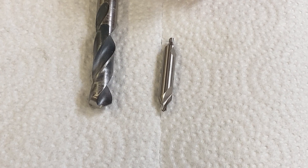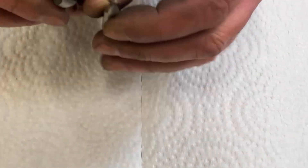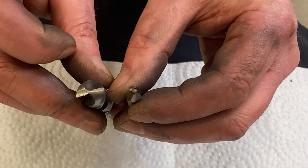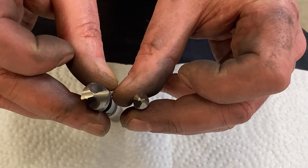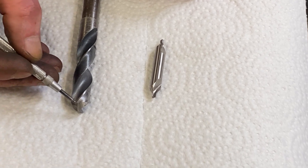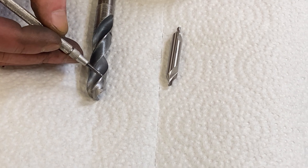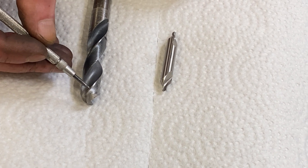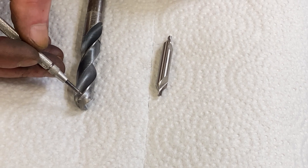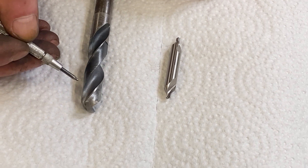First let's compare them to a regular drill bit a little bit. They both have a very similar end with basically just angular axial clearance on there that does the drilling. A drill bit has this land portion just behind the cutting edge all the way up the length of the flutes, and it's round — or more properly it's cylindrical — and then the whole area behind that is relieved so it can't rub and pick up and cause extra friction.